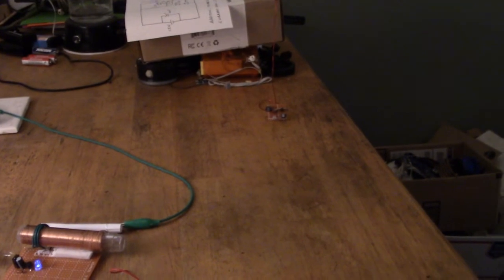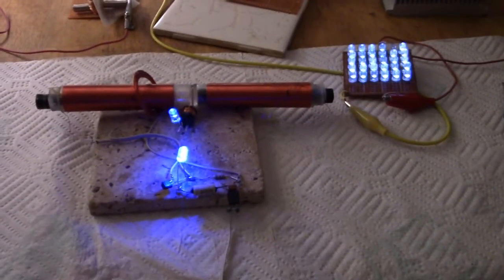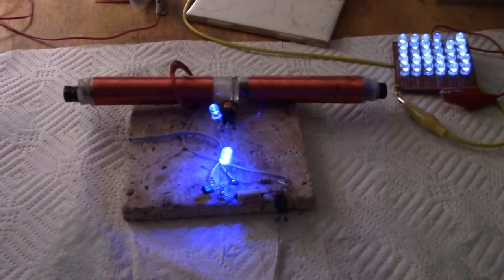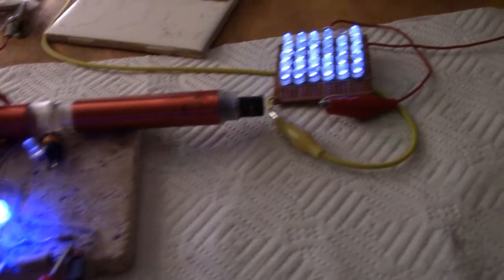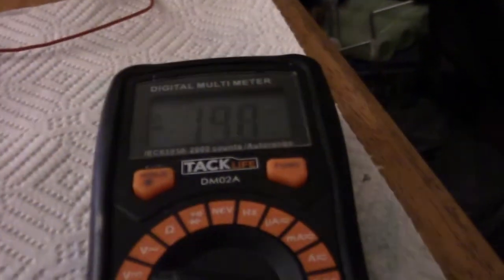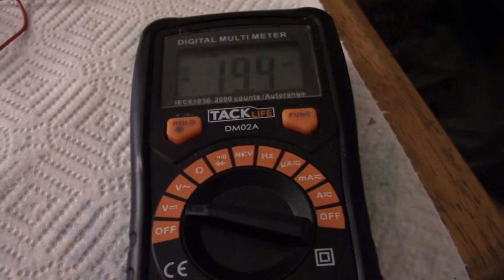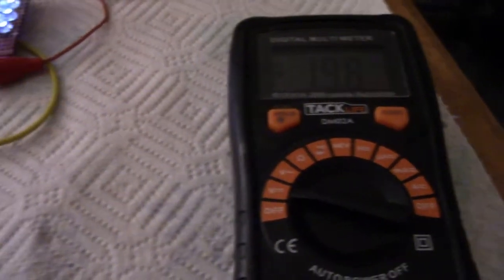From the heat sink of the Dollar Tree bulb we've got that exciter on it, and then a wireless pickup using one of those dupe coils that goes out to a coil with a Stifler loop on it. And finally over in the corner, flashing away, is a blocking oscillator with a little bulb thing on the top. Next I'll show the input amperage — the driving voltage is 5V from USB. I've got the probes across a 1 ohm resistor and this is reporting about 19 millivolts, which is 19 milliamps — I can't believe that for one minute, it just seems far too low.